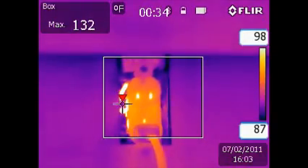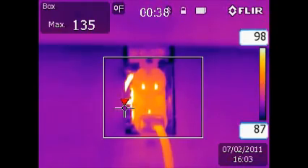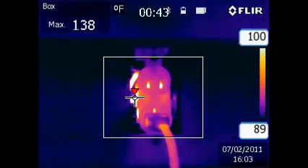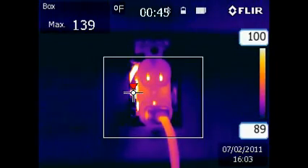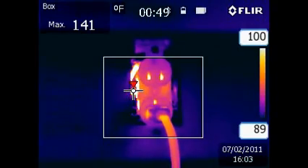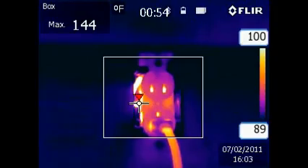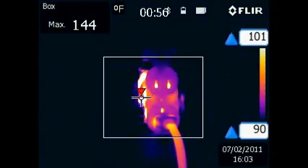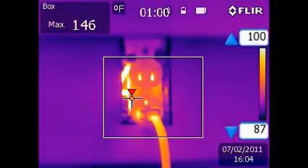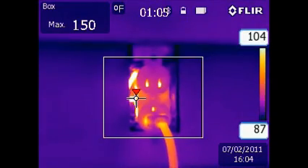In this next section is a receptacle that I found that meets the exact scenario, all but the fire — but that is just a matter of time as you will see. This receptacle is an outside receptacle that is parallel with two rooms. There are 10 receptacles on this one circuit. For demonstration purposes I plugged a standard portable electric heater that only pulls 12 amps. I put an amp meter on this circuit at the time of test and the load was at 13.5 amps, so there was only a 1.5 amp load being contributed from the other 9 receptacles, which in a normal day would be much higher.